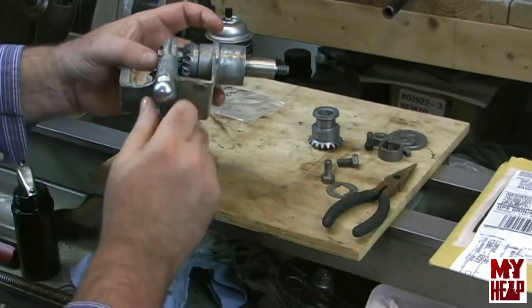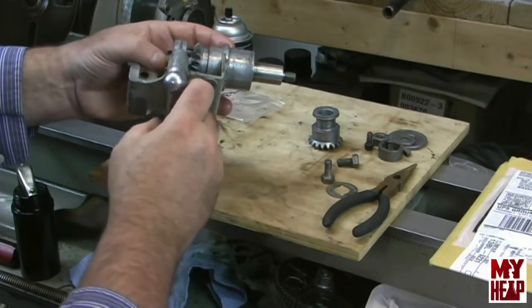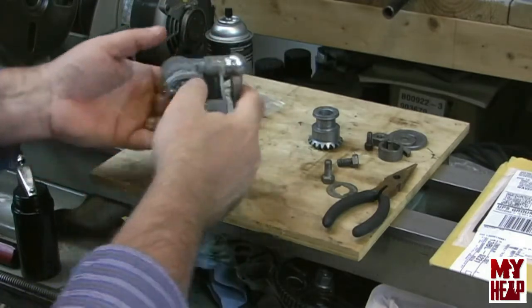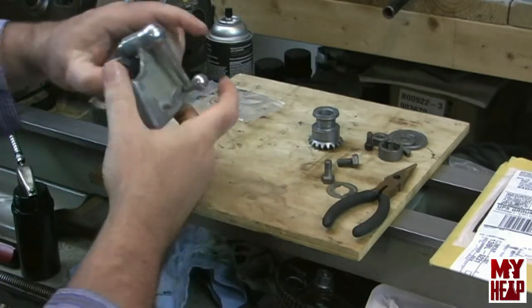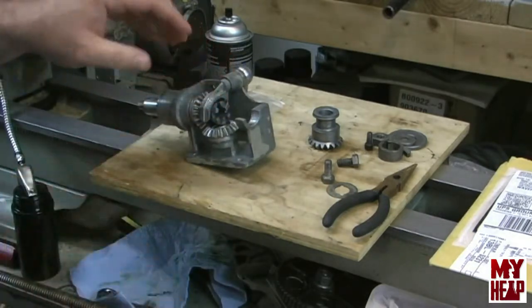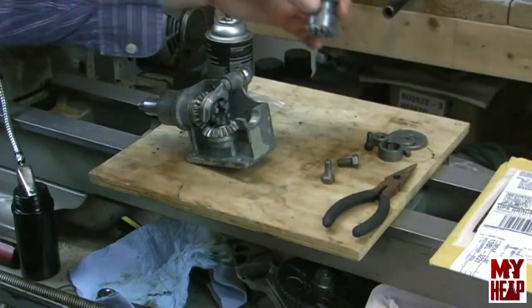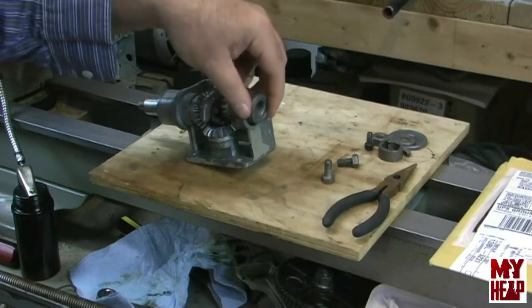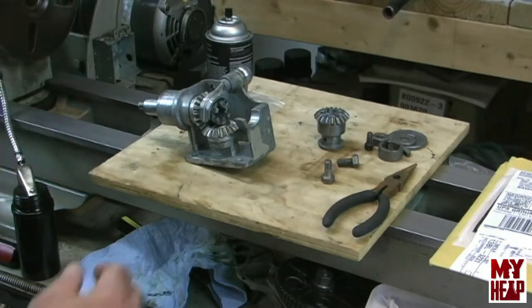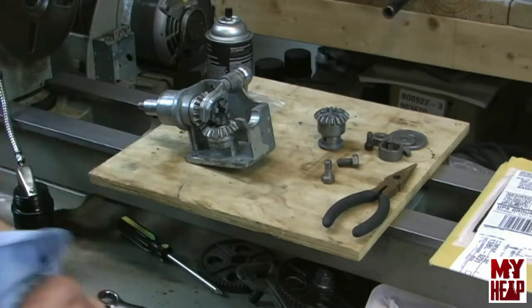So this is the neutral position, forward or reverse depending on how the gears are set. It's kind of hard to hold this in alignment — the lead screw actually holds everything in alignment. So this is essentially together and can be bolted to the lathe. Remember, the lead screw just passes through this one here — it's an idle. Let me wipe some of this oil off my hands, reposition the camera, and let's get it installed on the end of the lathe.